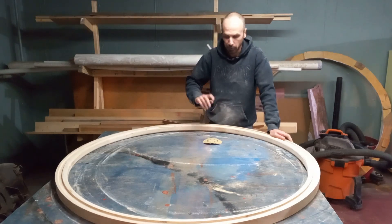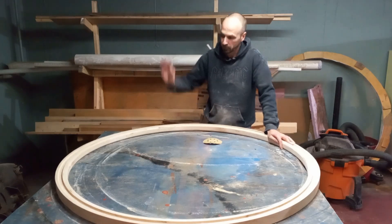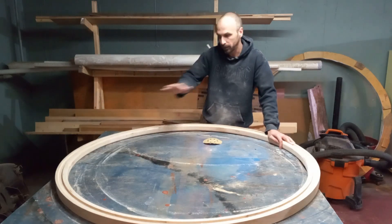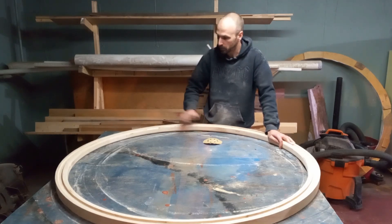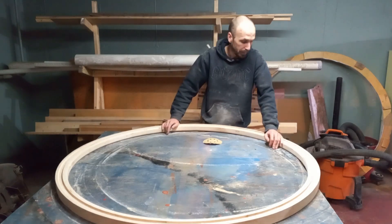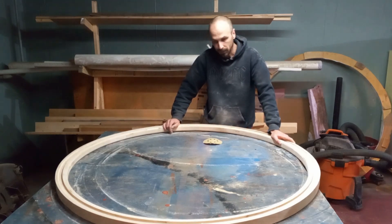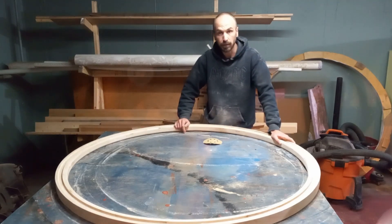After a few hours of sanding we've got this pretty well flat. When we took it off the table our overall thickness was roughly two inches, but it was wavy — I believe because my outside jig used for surfacing wasn't perfectly flat, so when we ran the router over the top it came out wavy. It took a lot of sanding to flatten it back out. We're within roughly a 16th overall, which should be good enough, but in doing so our overall thickness dropped down to roughly an inch and a half to an inch and three-quarter.